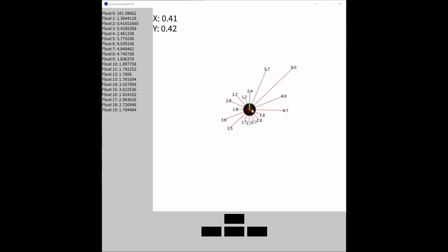And the green line is the direction of the steering axis of the robot, so that can move independently from the turret with the circumferential ultrasonic transducers. But for now I have a PID loop that's trying to match turret 0, or rather transducer 0, with the direction of steering. I also have my phone duct taped to the top, facing in that direction too, so it should always have the camera pointed in the direction of travel. Down here, that just shows which arrow keys I'm pressing to steer it. They will light up green when I press forward, back, left, right.